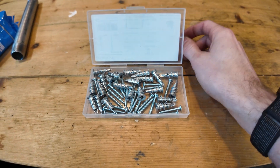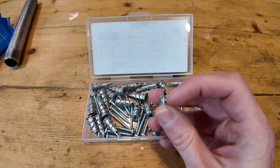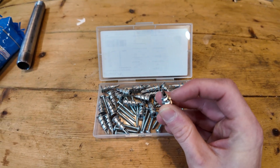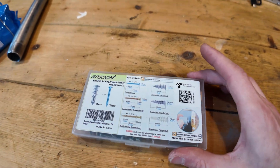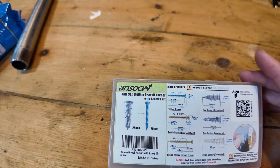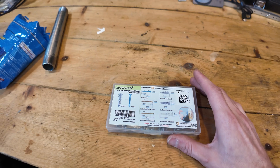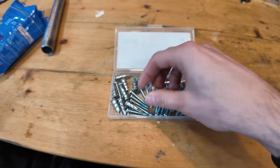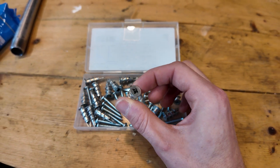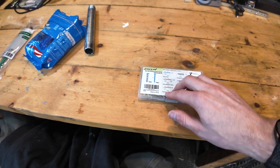To hold those junction boxes in place, I bought Home Depot's version of these anchors and they were total garbage — the anchors themselves didn't have a hole in them, so as soon as the screw hit it, it would just spin the anchor and strip it out. I also happened to have bought the Ansoon brand from Amazon because I didn't think the Home Depot ones were going to come in time, and these actually worked out perfect. They were thicker, went in stronger, and did not strip out when I put the screws in. I'll put a link in the description — that's the only thing that came from Amazon; the rest was Home Depot or Lowe's.